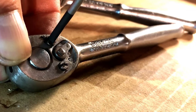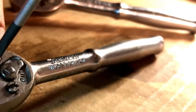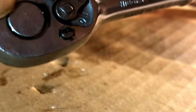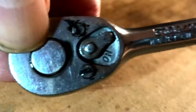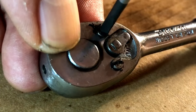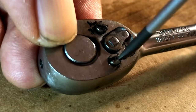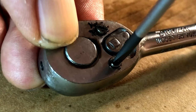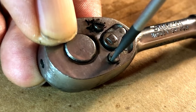Probably the old — look at the grit and stuff that came out of there. The Ballistol oil probably helped dissolve some of that dirt and cemented old grease in there, which is why it loosened up the mechanism. So what I would recommend: if you're going to do one of these and it's really seized up, get some oil in there — it could be Ballistol, WD-40, whatever you want to use.